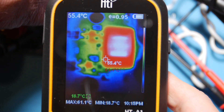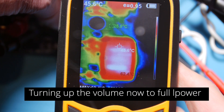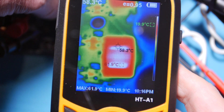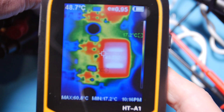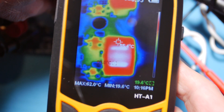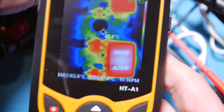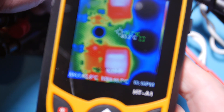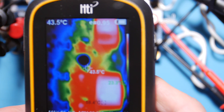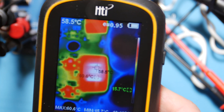Reaching down to grab the pot — you can see those transistors. Right now things are like 45 degrees, the inductors are like 58, starting to cool down. But even just idling, the inductors stay warm because they're smoothing that wave shape into a sine wave. Cranking it up — the output is 24, 28, 30, 35 volts right there. Cranking it down just a little bit, right around 34.9 volts. Now we'll see how hot this thing gets — I've got the center of the screen right on that inductor, the hot spot.